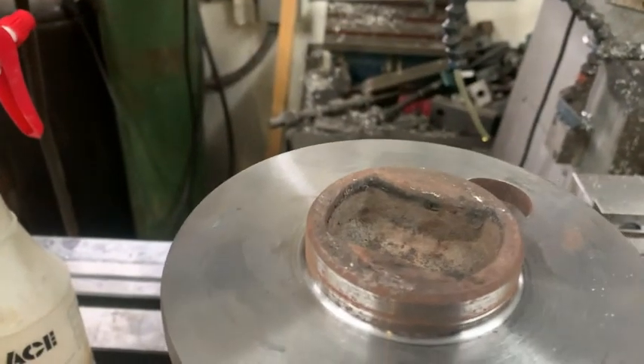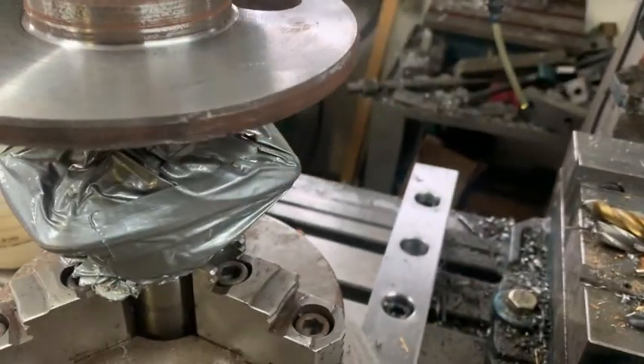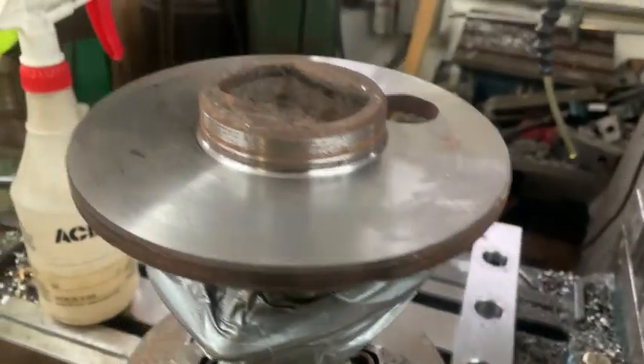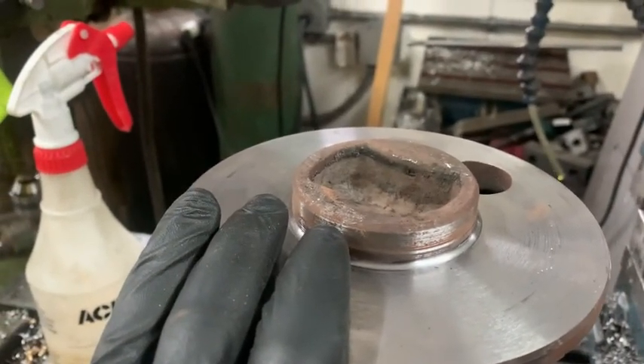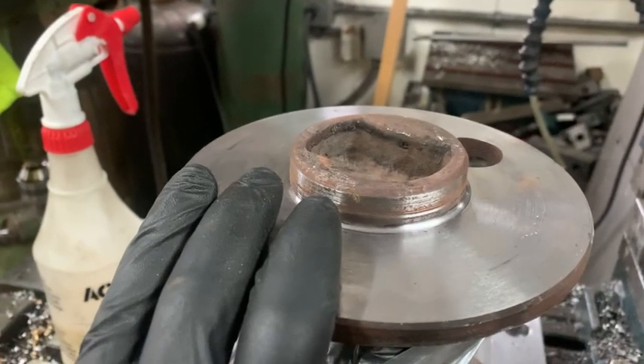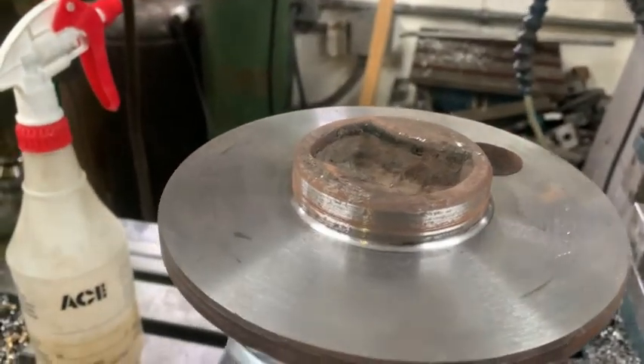So what we need to do now is set the angle — I think I'll go right around 45 degrees and use a center drill to see exactly where I'm at. I do have to dial the face in, because when you move the turret out on the mill it could be off. My parallels are precision ground — I checked them on a pink inspection surface table and they're within about two tenths on flatness and parallelism, so for a job like this, more than accurate. Next step is to tram it, dial in the spigot, and put five holes in.